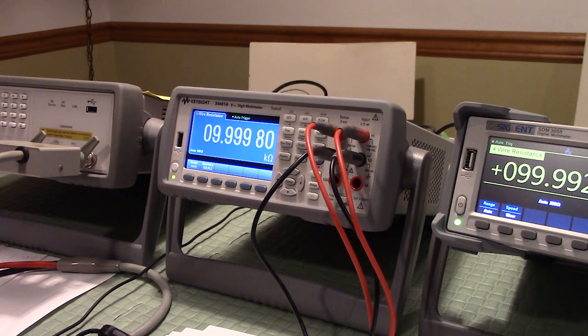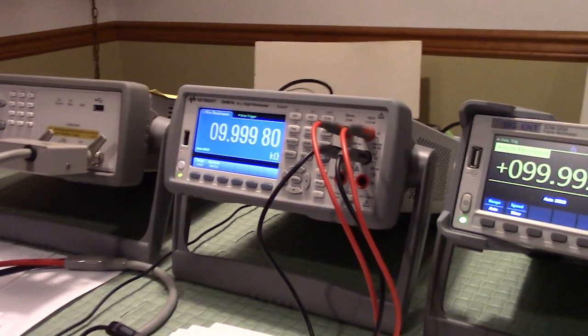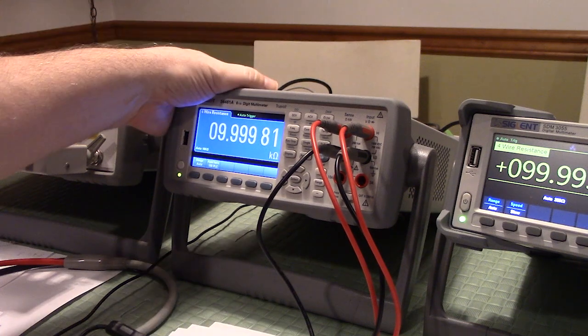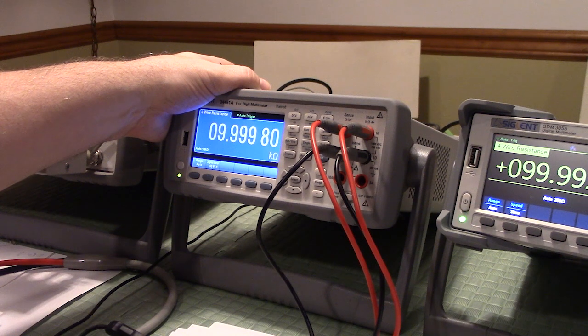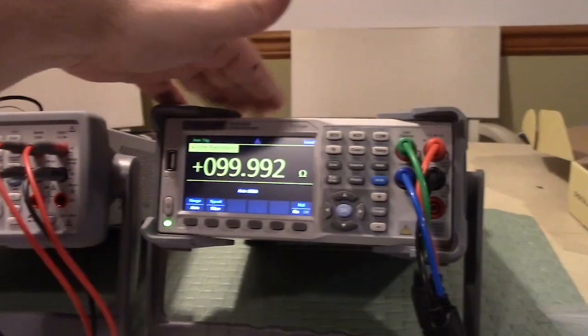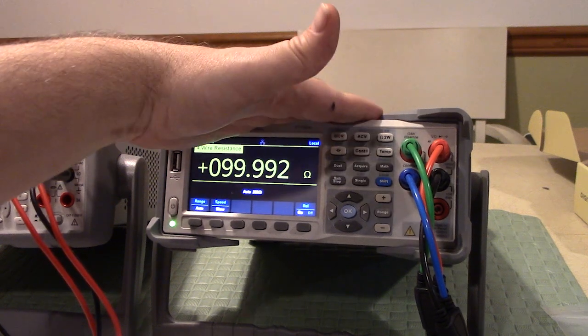That is the beauty of this precision equipment. Siglent for the price is just knocking things out of the barn, especially considering this meter has gone through a lot of trauma. The Keysights are going to be kept in a climate-controlled, humidity-controlled area because their purpose — especially the new one — is calibrating all our other equipment. For the Paradox 3, we're developing a telemetry package to measure voltages, and I need to calibrate those measurements against a known good reference. That's what the Keysight will serve. And since the Siglent is verified against the Keysight and showing equivalent results, it can also be used as a calibration reference.